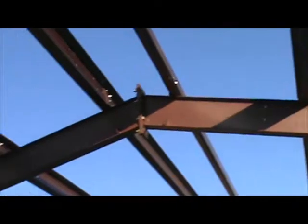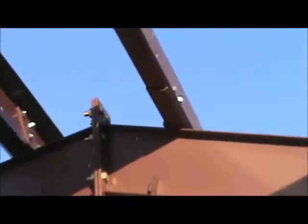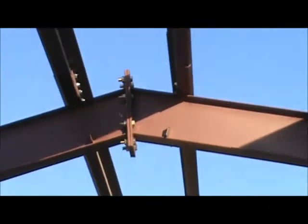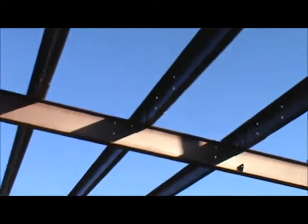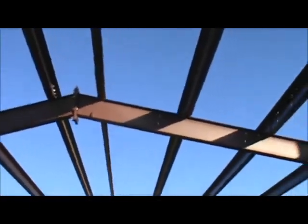All right guys, they're all bolted together. On the end, you can see the 4 holes. The end 2 holes, where's my finger? There. The end 2 holes, there's nothing there. I need to put 2 more bolts on each side on the ends, and then I'll be good. That rafter right there, I got backwards. See how it's not laying together properly. And that one right there, it's not sitting together tight. So tomorrow I need to flip them and flip that one, and then we'll be in good shape.